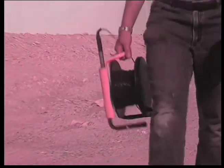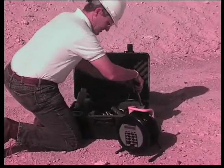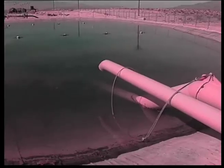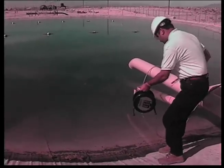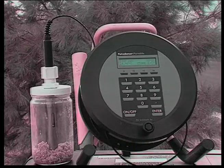The PetroSense PHA100 is a portable hydrocarbon analyzer that makes real-time in situ measurements of PPM levels of petroleum hydrocarbons. It provides fast, accurate, and quantitative data for petroleum hydrocarbons in water and vapor, the water-vapor interface, and soil. The PHA100 has better than 95 percent correlation with a laboratory gas chromatograph.